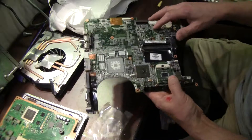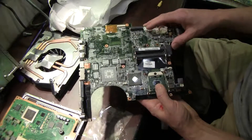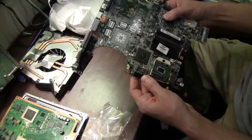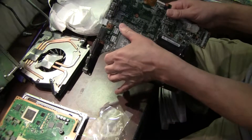Some of these also have a NVIDIA chip on the other side — I'm not sure if that's the Southbridge or the co-processor, but I saw it on some of the other boards. This one doesn't seem to have it, so we're going to go ahead and reflow the NVIDIA chip. We just did five of these boards and they all came out good, so we have about eight more to do here and then another load coming in.